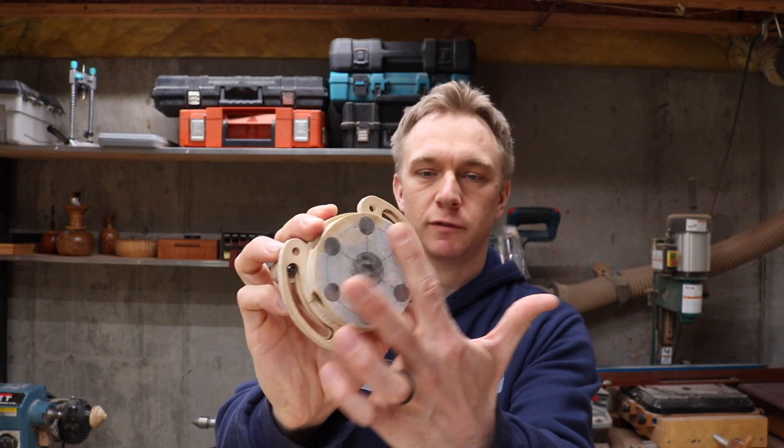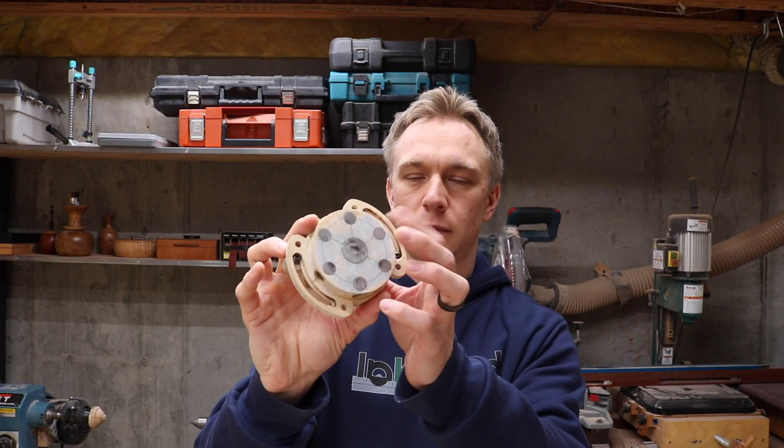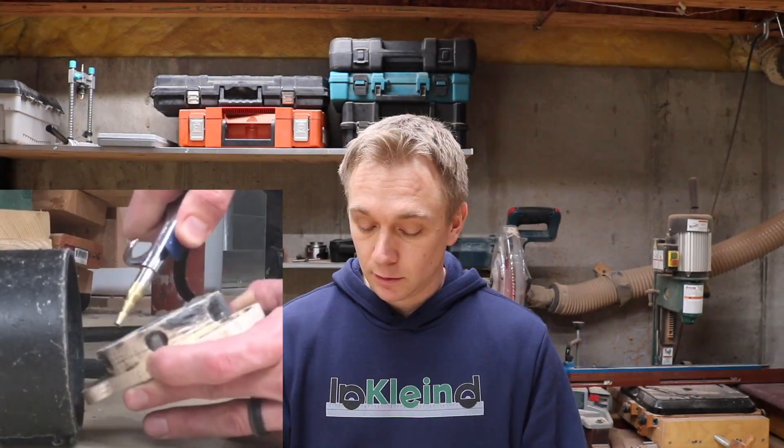Also, when flattening and tuning these you want the metal posts to be flush with the wood, so you may do some sanding or filing - and that creates lots of little magnetized shavings stuck to everything, which is a real pain to clean up. The best thing I found is to put it right next to the intake of your dust collection and use a compressed air gun to blow all of those into the vacuum. High pressure and vacuum at the same time takes care of it pretty quickly.